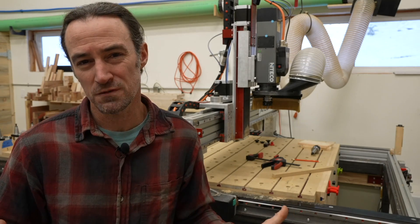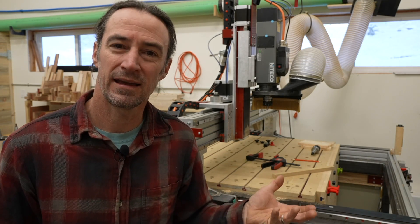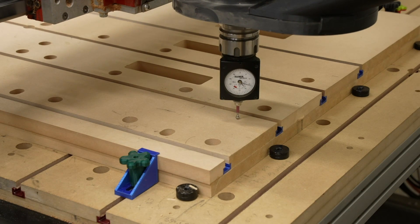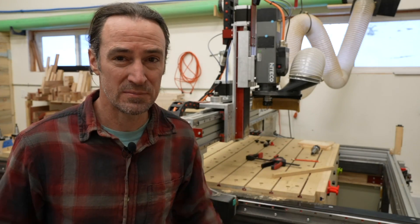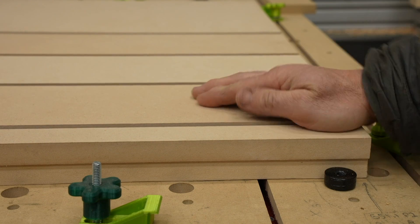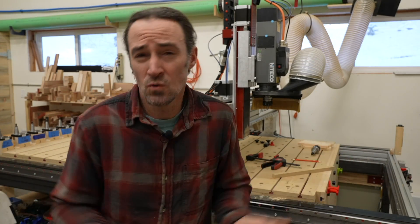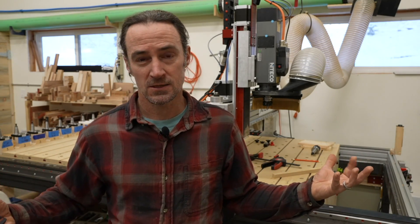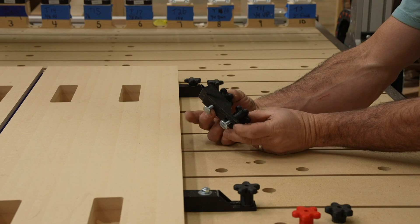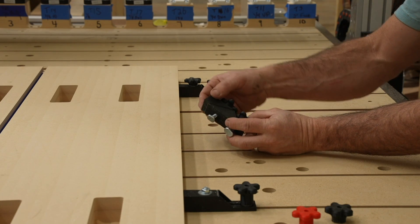At this point I needed to surface the entire piece. I tested for flatness and it varied somewhere from 10 to 15 thousandths when I ran my dial indicator across the table — that was just too much variance for me. Here's the problem I hinted at earlier: when I remove the clamps, the workpiece curls up about 30 thousandths of an inch, which is quite a bit. I could ignore the curl and surface the top flat, but when I mount the vertical table to the machine it will warp again. I needed it tightly held down without any curl. Luckily, I'd recently been working on some side clamping devices to deal with exactly this problem.